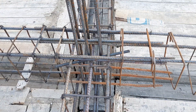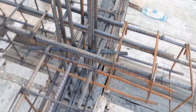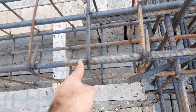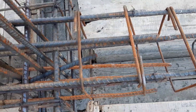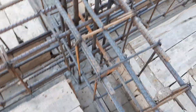This is not proper steel reinforcement design. I am telling you: you should hire a structural engineer to provide you with proper structural design for beam, column, and slab. Unfortunately, they don't have that knowledge — they are just doing the reinforcement design based on what the steel fixer knows. You should always have a structural drawing for any structural member, whether it is a beam, column, slab, or staircase.